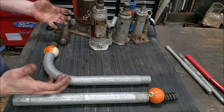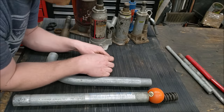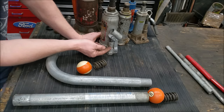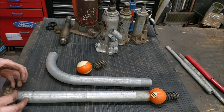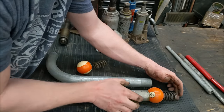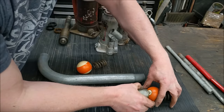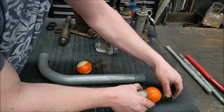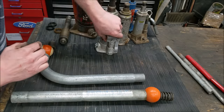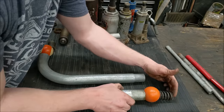It's able to do all this with check balls — essentially just a little BB and a spring. When you pull the rod up, fluid from the reservoir needs to fill the small chamber. The suction pulls the check ball back past its weak spring. So the piston creates a little suction, pulls that ball back, and lets fluid in. When we push down, the fluid actually helps push the ball against its surface with the spring's help.